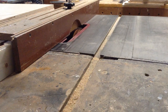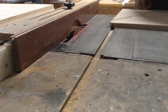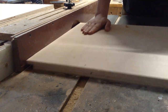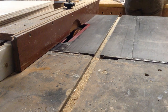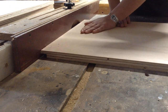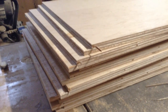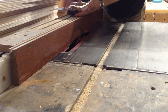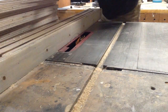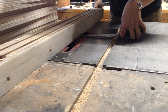The first thing I'm going to do is make all the cuts: a bottom-side dado, a top-side rabbet, and then a middle dado which will hold the piece for the shelves. At the top I'm cutting a rabbet — sometimes I don't go all the way through because on the inside I don't put a full sheet of plywood at the top. I put three- or four-inch strips at the top, but because these are drawers you'll never see this, so I decided to make my life easier and do a full rabbet on the top. For cabinets where you open them, sometimes I end up chiseling just four-inch rabbets and chiseling the curved part on the back to make it a little bit nicer. For anything sitting on the ground I leave a little quarter-inch foot on the bottom.